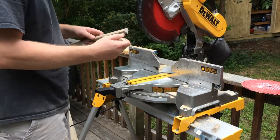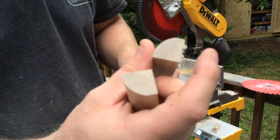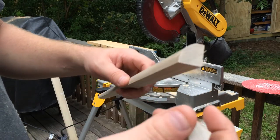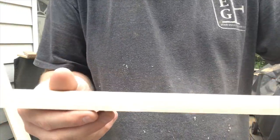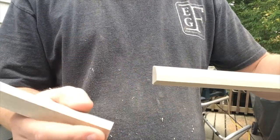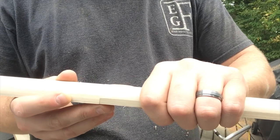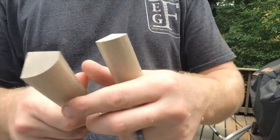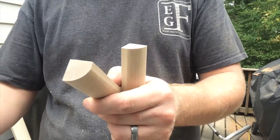So I've got my two pieces that I cut. As you can see, there's not really any tear out on these pieces. There's a little bit of fluffy stuff there, but you can just wipe that away with your finger. You don't have those huge chunks missing like you do at other times. So this piece was on the cross cut saw like this. What I'm going to do to check out and see how well my measurements and cutting were — I'm going to flip this smaller piece end over end, flip it so the round pieces are facing the same way. Just kind of line up all both flat edges and the round edge, just see what it looks like. If it's not matching up, then what that means is this edge right here and this edge here are not the same measurement. If they're not, that means you're going to have a lot of sanding to do.